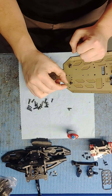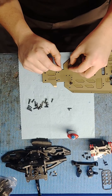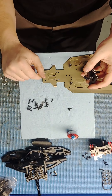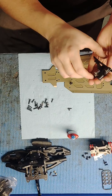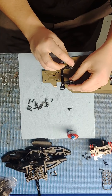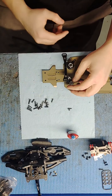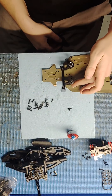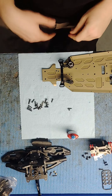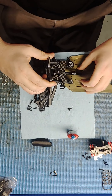I use a 6 millimeter shim on the posts — just one shim down on the post before you put the servo saver on. I only have one right now so I need to order more. Drop on your servo saver, make sure it's super free — you don't want any resistance on that. I want that super, super free. Then we'll bolt the front end up; make sure you put the drive shaft on under.